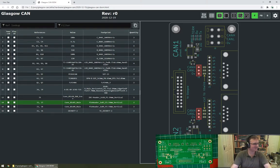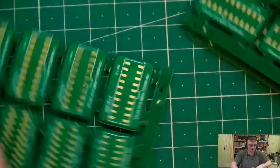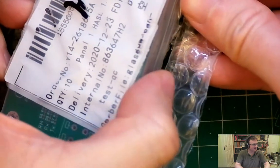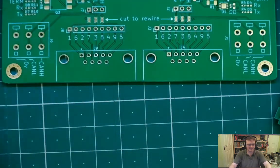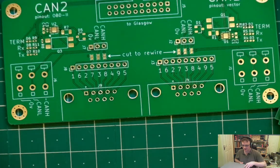I haven't done one of these on stream before. What I'm going to do is use some old PCBs to surround the board and pin it in, tape it down with Kapton tape, and then put the stencil on top. Unfortunately the stencil is actually pretty large — much bigger than it needs to be — which could make it awkward to get everything in place.